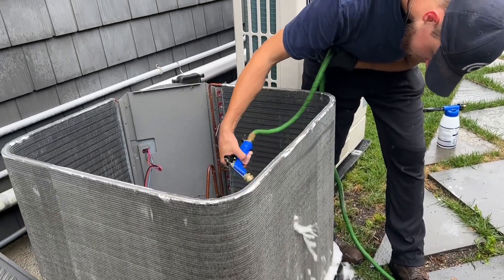We're going to get this coil clean and start her up and move on to the next. Ladies and gentlemen, I'd like to poll the audience — I know about 50% of viewers are in the trades, and maybe half are in HVAC. How many of you actually clean the coils once a year? If you're not cleaning those coils once a year, you're doing a disservice to your clients. Check the coils, clean them — even if they look clean, give them a rinse. Before it turns into a fur coat, those coil fins clog up. Check your coils. Mikey Pipes signing off — be well, God bless, stay safe.